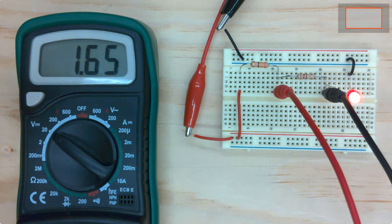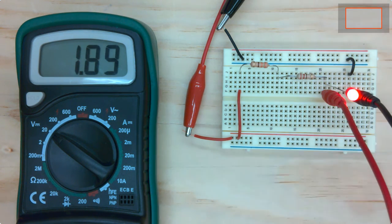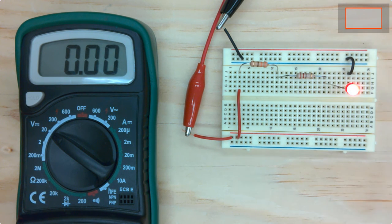And then if I want to measure the voltage drop across the diode, I just put the probes across the diode like that. You can see it's about 2 volts, 1.90 volts. And using this technique, we can measure any of the voltages that occur in this circuit. All right, I think we'll stop there. Thanks for watching.